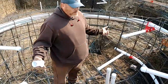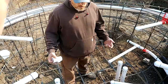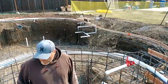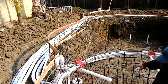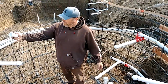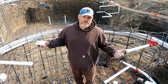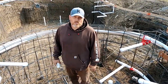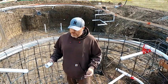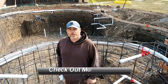That's the basic way a spa works. There are actually five pipes that come into this spa — so there's actually more plumbing going on in this spa than in the rest of the whole pool. You can see how it works: where the water comes in and where the water gets sucked out. If you have a spa, this is most likely how it's been installed. This particular one has a separate jet pump from the filter pump. Sometimes your jets are your only returns, and that's a way to do it as well.